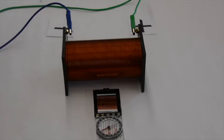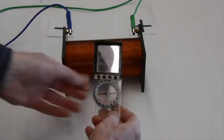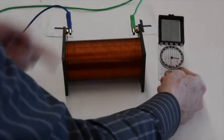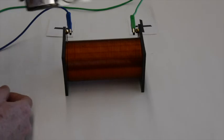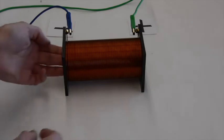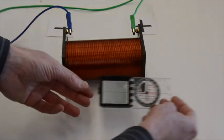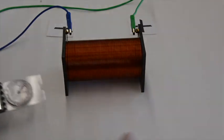Connecting positive and hitting the negative terminal — as soon as I do that, you see that the magnetic field changes. The compass is showing that the magnetic field is now pointing that way. The magnetic field is pointing out here, and to the right and to the left around the solenoid. Above the solenoid it's pointing to the left. Inside the solenoid, the magnetic field is pointing to the right — that's true all the way through the inside. The magnetic field is quite strong inside. Outside, it's pointing in the opposite direction, going north to south.